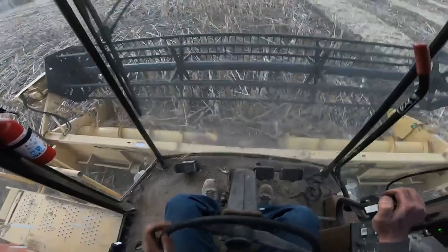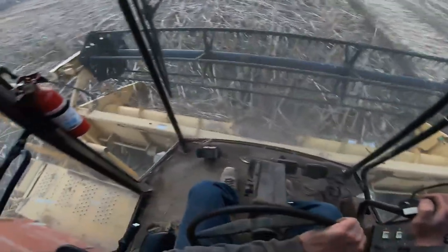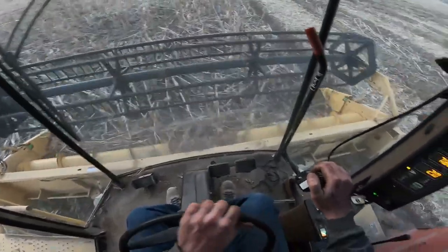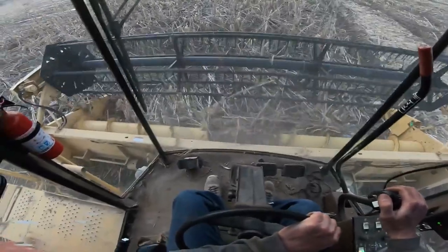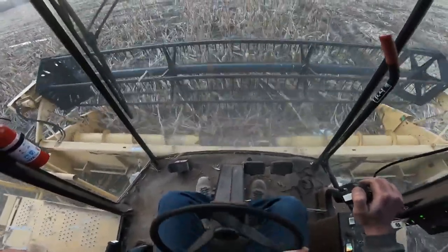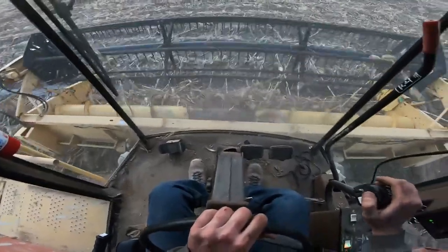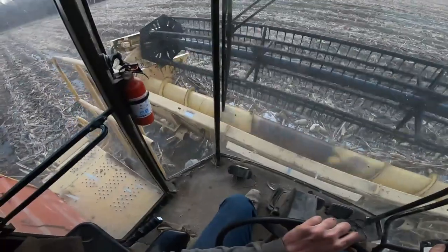I've got a little bit of standing stuff here. We can go faster to match the reel speed, but most of the time we're trying to get underneath. Now I'm going 90 degrees to the rows, trying to get underneath the very tippy top of the plant. I've got the small cut sickle sections on here, and I don't know if they're cutting the stalk so much as it's just breaking off for us. I think it's good to have the smaller cut style. We've got to put down the reel to hopefully catch the few ears and make sure they don't fall out there.